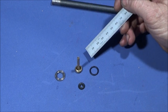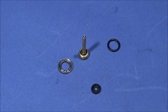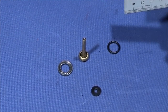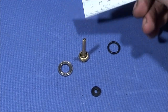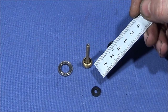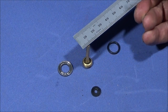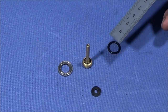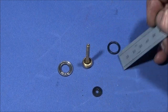It had work hardened or age hardened. The washer on the actual inlet valve was also hard and not working, and I changed the main o-ring on the actual valve assembly as well. I very much doubt that this rifle has been taken apart since it was made in the 1970s. This part here was bent on the actual shaft, so when the hammer struck it would just jam at a certain point, and obviously the air pressure couldn't be built up inside with the hardened seals anyway.